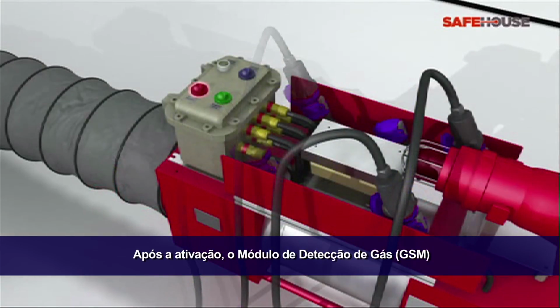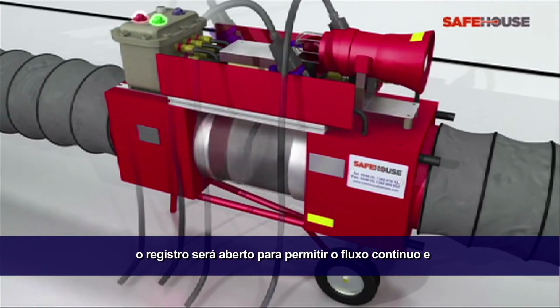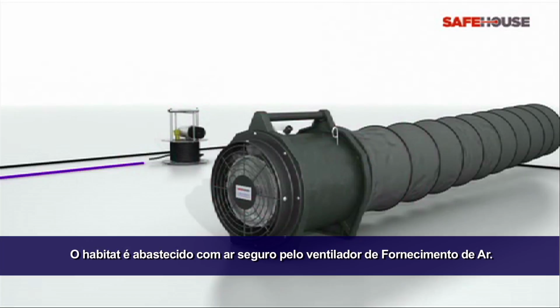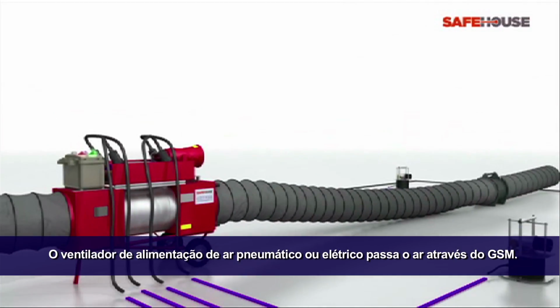Upon activation, the Gas Sensing Module, GSM, carries out a series of safety checks. Once the checks are completed and the GSM is activated, the damper will open to allow the continuous flow and monitoring of the supply of fresh air. The air supply fan delivers safe air into the habitat, passing it through the GSM. The fan can be either electric or pneumatic.